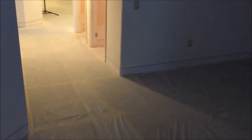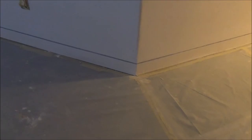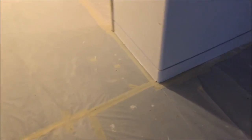Peck band. Lots of 22.5 degree corners inside and out. So there's lots of angle cuts to be done. Use the Trimtex half inch reveal bead and super seal gasket LB tear away on the bottom. It's going to meet the tile, which is under all this plastic.